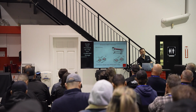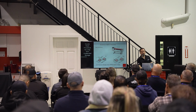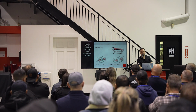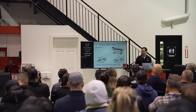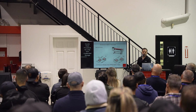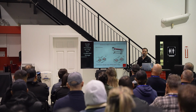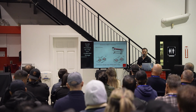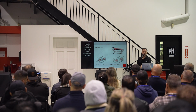You select nozzle wash, and the carriage will move over, and it'll walk you through the procedure, which is basically taking some of the cleaning liquid that comes with the machine or that you can order, and when it tells you to, dropping it in, just like this picture here, and filling it up. Once you've gone through the procedure, it's going to ask you how long you want to keep it in the nozzle wash. It's going to park the print heads onto those caps with the liquid in there, and allow the liquid to eat up any dried ink on the print head surface.